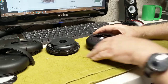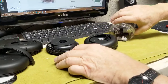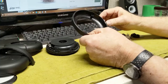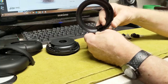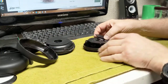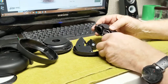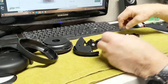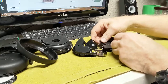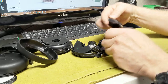What I did was cut the bottom half of this one in half, so you can see it's all in parts. I cut the bottom half off and was able to get the O-ring off. Cutting the whole thing in half revealed the two halves. This is the metal part, and this is the plastic piston — there is an O-ring that I seem to have lost here. This piston fits inside with the O-ring, and that's what creates the vacuum.